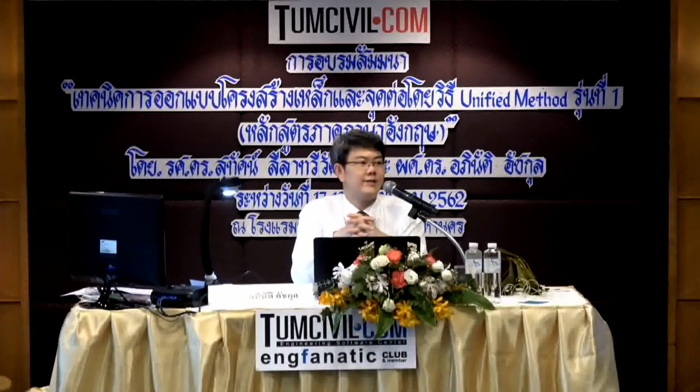Oh, that's another beast. If you talk about the 2.3 millimeter or 3.2 millimeter, that's a cold form steel structure. And I think they perhaps have a different specification for welding. Right. My apologies, I don't remember, but yeah, it's a different kind of steel. It's called cold form steel structure. And they have the way to weld it, but it may use a different approach from this because it's so thin, yes.